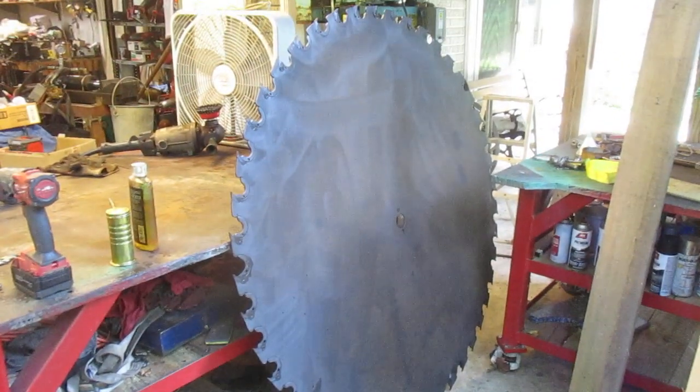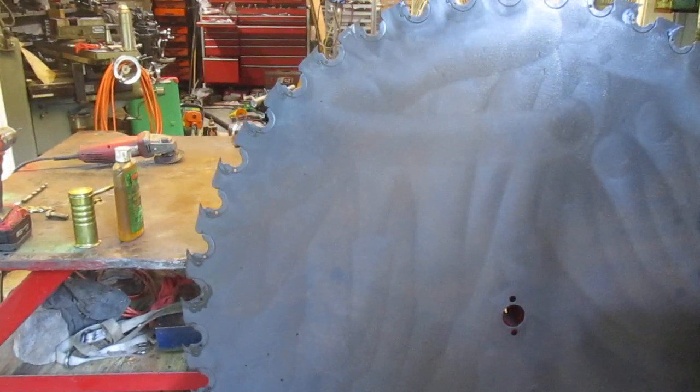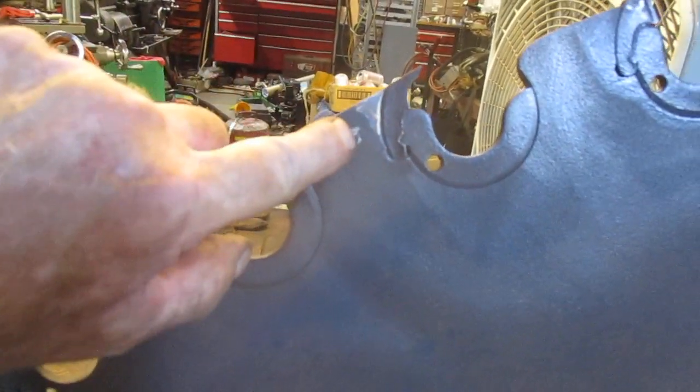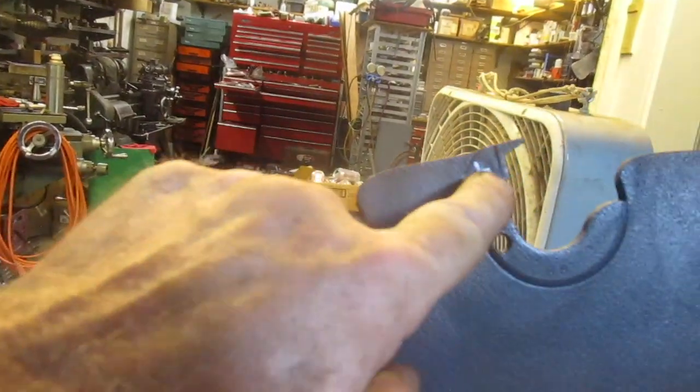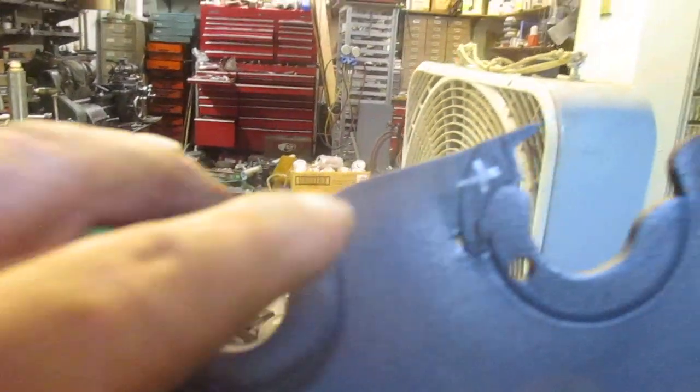We're still working on that blade, it looks a lot better than it did. This thing had a catastrophic failure somewhere along the line. You can see an insert where somebody repaired the shoulder here — looks like they did a real nice job. Then here and here they put in two of what they call stand-all teeth. And down here there's a shank with a crack in it, so that was not looking too good.